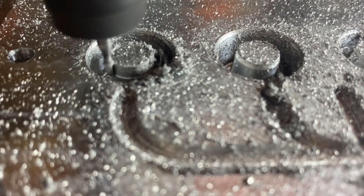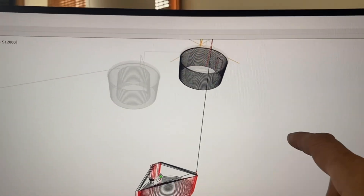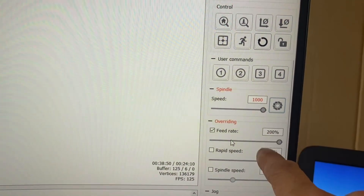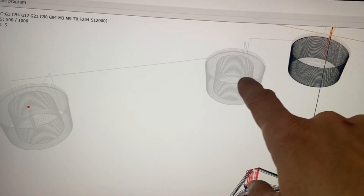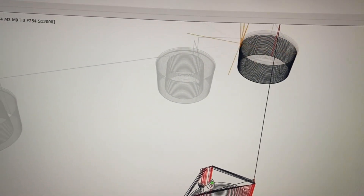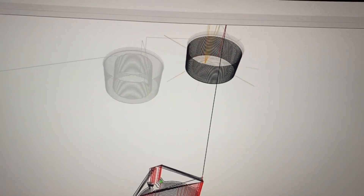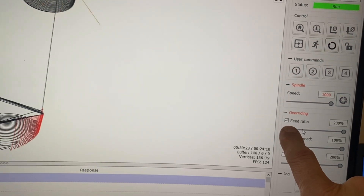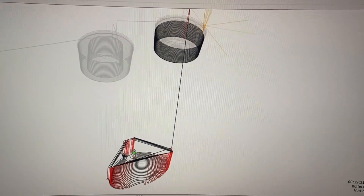I slowed down the orbiting at the very bottom of these pieces, then I'm back up to 200% — mainly because I messed up. I actually didn't machine the very bottom of the pocket finished. I thought I had, but I had left in the code to leave 0.2 millimeters of stock behind. So when the bit got to the bottom, it had to cut the full thickness of the bit down the last couple of loops. By using the speed override, I was able to not crash the mill and not break the bit, and I can go back in the next operation and machine that bottom piece.